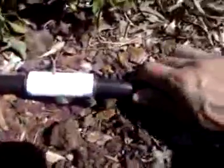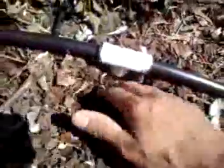So, and then it, of course, comes out here as well. Here's the main line source from the valves. I teed off as a riser on a 1/2 inch riser, cut it, glued it, and put these slip cap couplings so the poly tubing can be pushed into. So that's that.